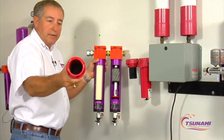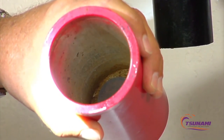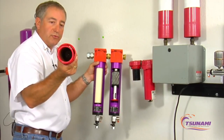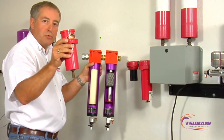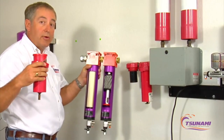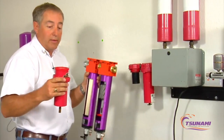If you look down in there, you're going to see a float drain that sits at the bottom of that bowl. Any garbage normally hits your first stage filter first, and that's generally where you have most issues with your float drain. Float drains — just as in some of our other products — it's not a matter of if it'll fail, it's just a matter of when it'll fail.